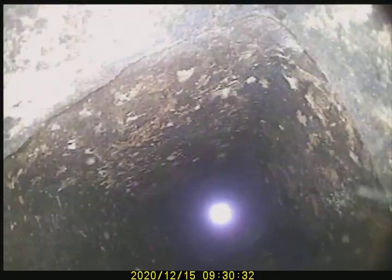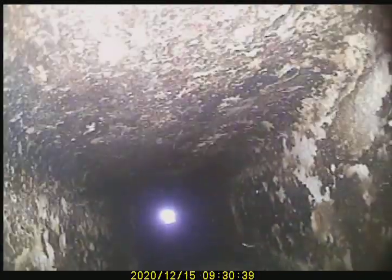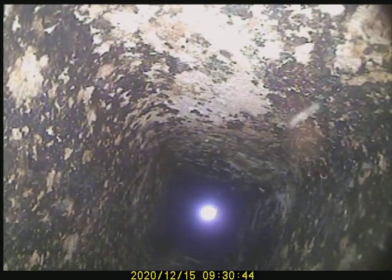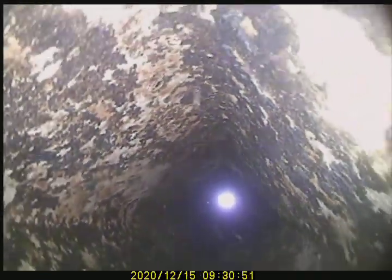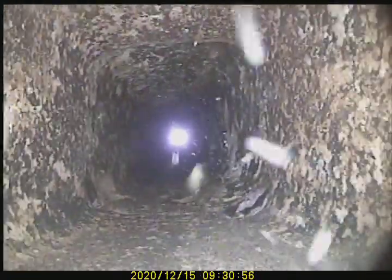We have a 4x8. It's a direct shot with zero offsets so far. A lot of deterioration is present. This is the transition point where I believe we go from a 10-inch round to a 7x11 flue spread.